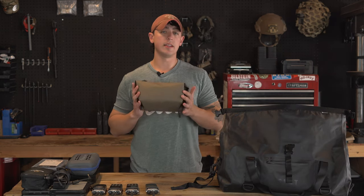My second Magpul DACA is my hand tool kit. In here I keep crimpers for RG58 and RG8-type cables, plus a separate crimper for LMR400 — you might find one with the right dies to crimp both smaller and larger LMR types, but I just have two. I also have a nice cable cutting and stripping tool, a pair of scissors, and a small spool of RG58 cable, which is good for vehicle installs or making temporary patch cables.